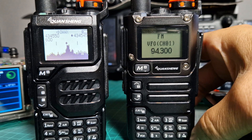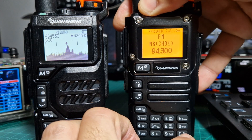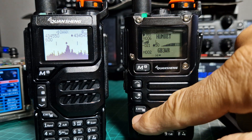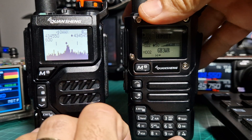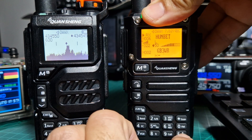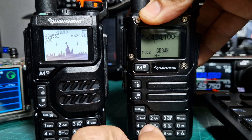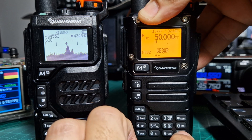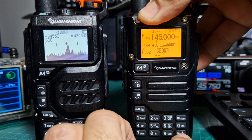Band-wise, press F on this one — F1 to come out of radio mode, then F-FM. The way it works is you press the F button and look at the numbers on the keys — they have functions. Press F then Band, go into VFO mode. F then number two toggles A and B — we're on A. Then F-Band to see the bands.